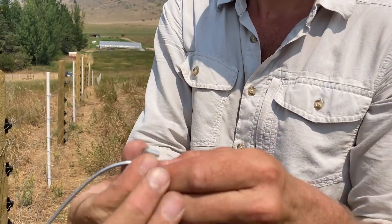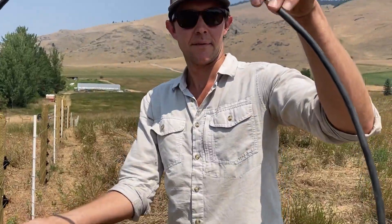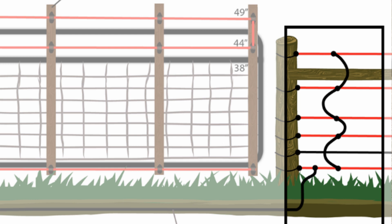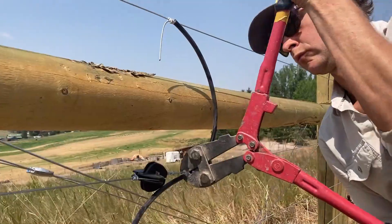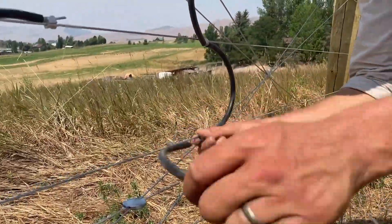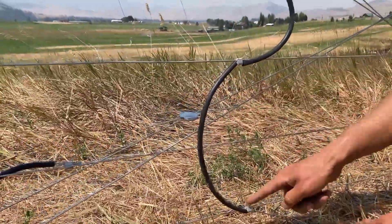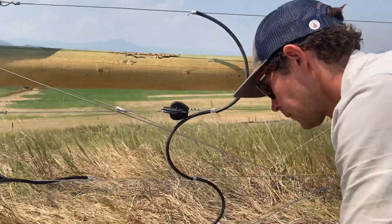We'll begin with a section of hot wires. Since the fence has five hot wires, I've built a jumper from plastic tube insulator, five open tap wire crimps, and high tensile wire. I'll crimp the taps in place on each wire, running my plastic tube insulator in an S pattern as I work my way down the fence. Make sure to keep track of your ground wire or wires, as you do not want to attach them to this circuit. Once the jumper is connected, I'll remove any loose wire ends to avoid the possibility of a short circuit.